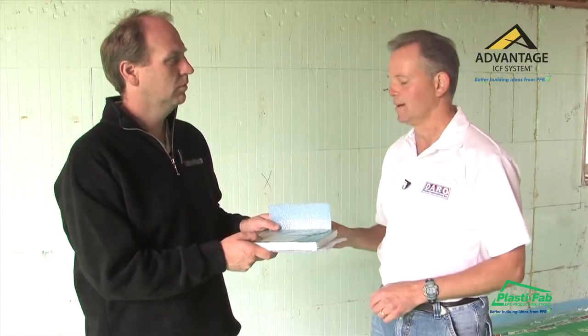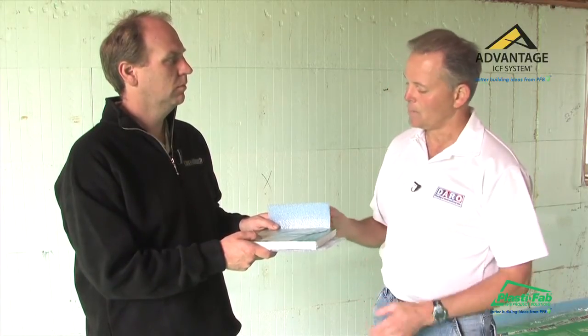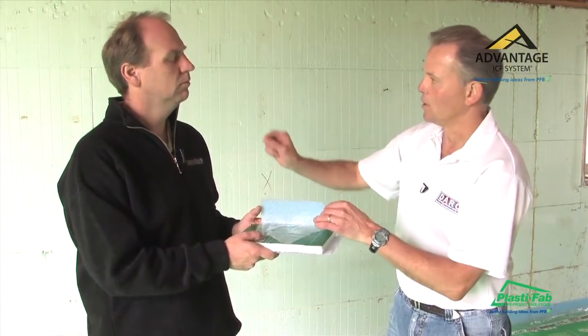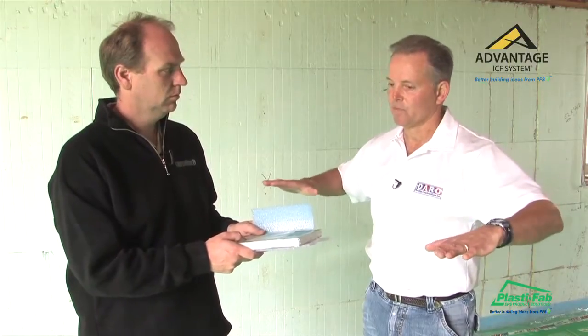We recommend in most cases that you build all your walls first. It usually speeds up the construction process on site, and the owner gets the benefit of no sound transmission between walls. This is also pre-engineered and pre-cut. Once your topping is down, this simply gets peeled off — it's a whole system. Everything has flexibility to move and you get a very uniform conductive surface for the heating.